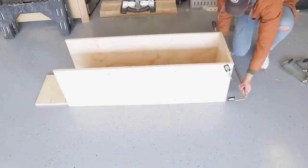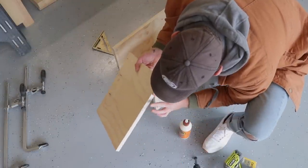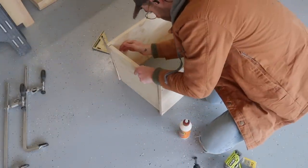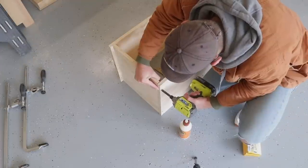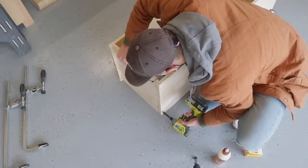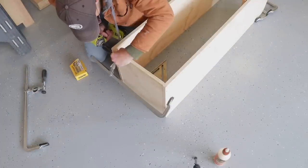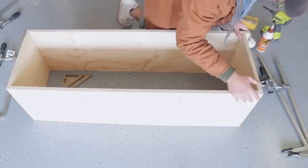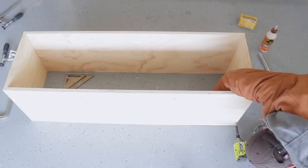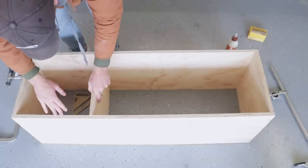Assembling this main cabinet was really simple. I used wood glue for good long-term strength — the screws are really just there to hold it while the glue dries. My big piece of advice here is to start square; it's easy for a cabinet to get really wonky if you aren't constantly coming back with a speed square to make sure your pieces aren't getting out of alignment.